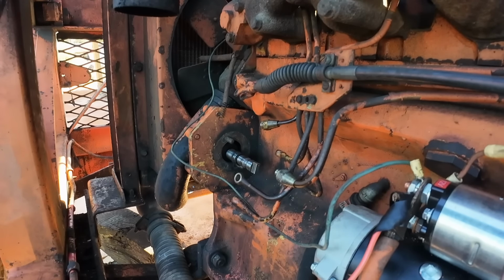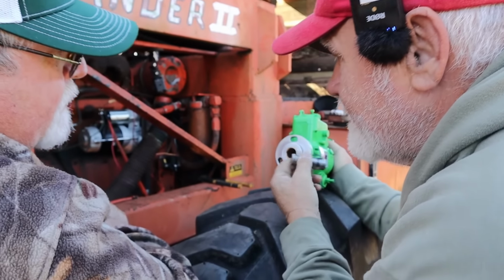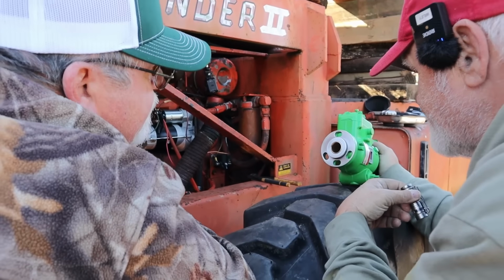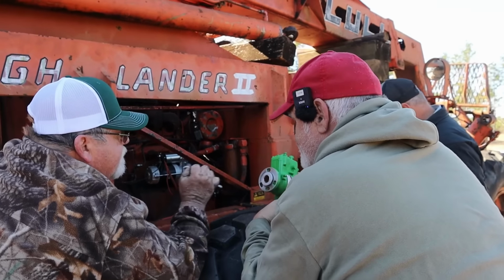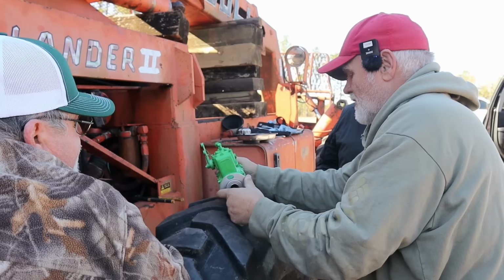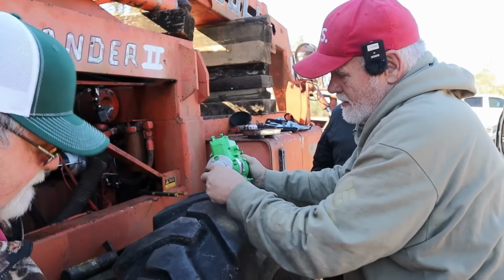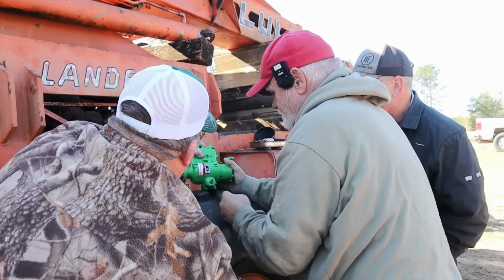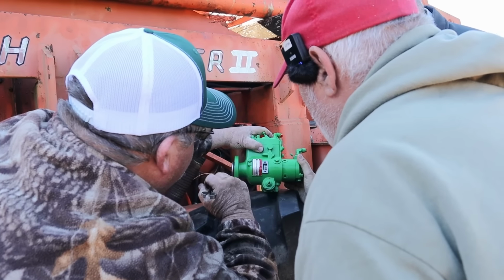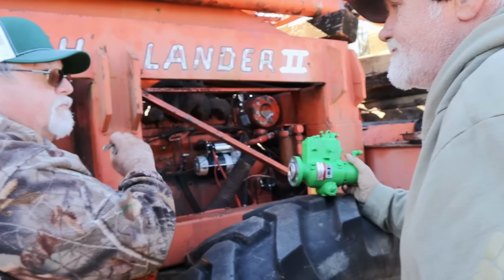We've got to line those lines back up on your pump. How do you do that? You'll have to turn that. Well, he's got it turned up, but if that motor's timed, then that's how you time your pump. Okay. Well, you know more about this than I do. So we turn this? Mm-hmm. Turn it to your lines. What do I need to turn it with? What kind of tool? Yeah, there's a line on this wheel right here. You can see it on the bottom. We seen when we done it, it was lined up on both sides. Yeah, well, that's where you're in time.